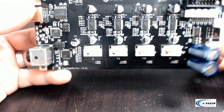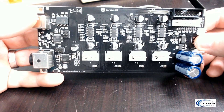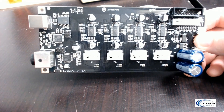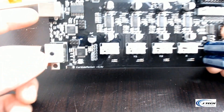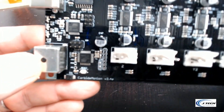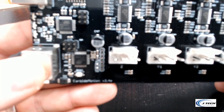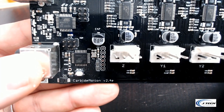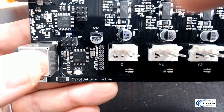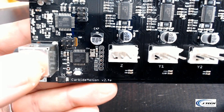The good news is there is another six-pin header on the carbide board, over on the left-hand side. There's the power and there's the USB — over by the power you're going to see a connector. Zooming in, this is the ISP connector, labeled ISP, and it has six pins.